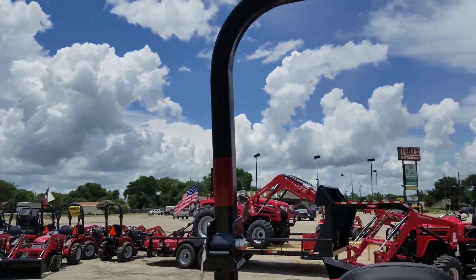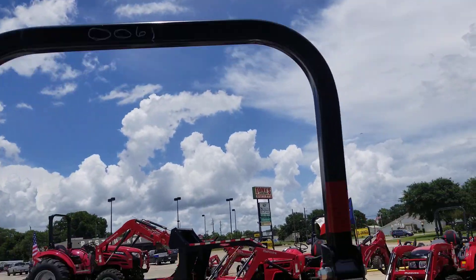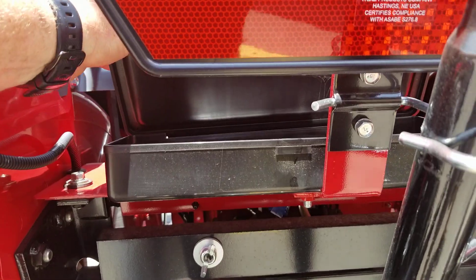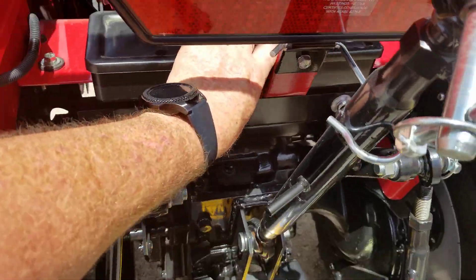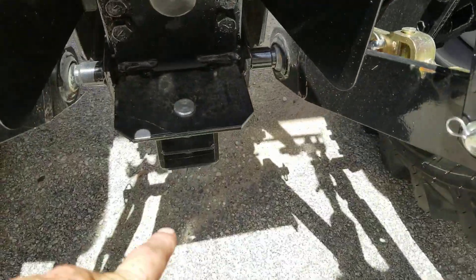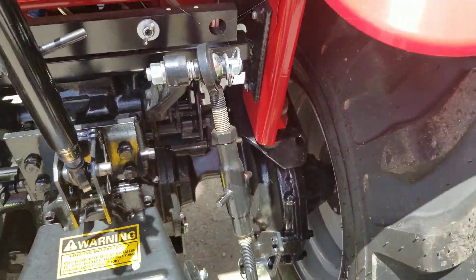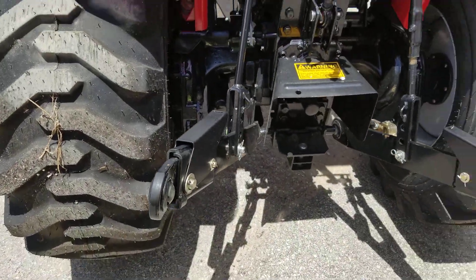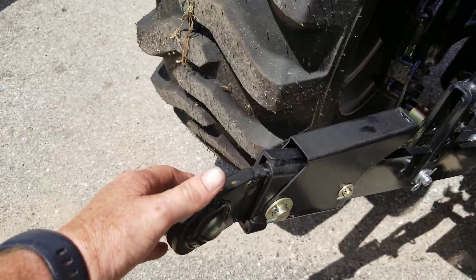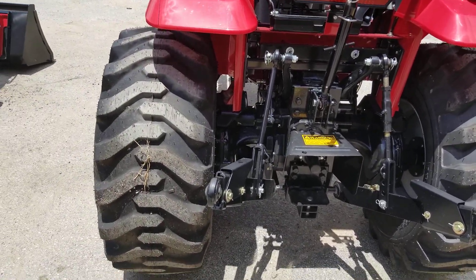In the rear, starting with the ROPS — rollover protection. They can fold down in case you put the tractor in a barn or shed, and you can also put a canopy on them. There's a small toolbox for pins or whatever else you need. All Mahindra tractors come standard with a drawbar, mounted out of the way with fly nuts — you can pin it right in. Cast iron rear end. No tools required to adjust the arms up and down. Compared to the 1500 series, they now have telescoping 3-point hitch arms — just press the button and the arms come out, then push them back in. Quick connects are available for the rear end in Cat 1 and Cat 2; on this tractor you'd use Cat 1.